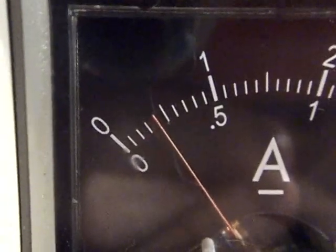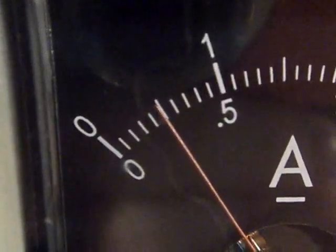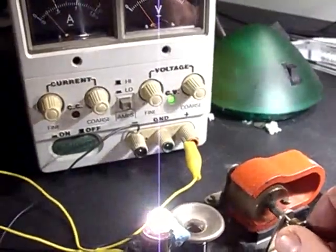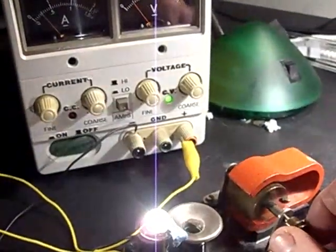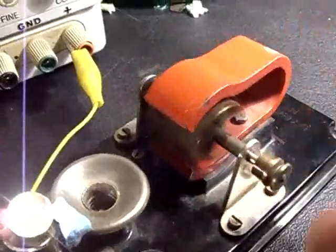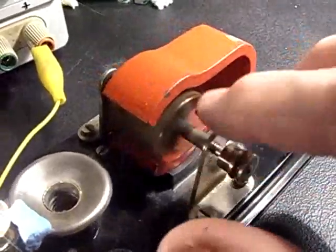Let's look at the meter — using 5 volts, it's using about 200 milliamps. Current increases with load. In an electrical machine, this is out of balance, of course — it runs out of balance. Power is wasted to frictional losses of various kinds: loose bearings, but also the out-of-balance armature.